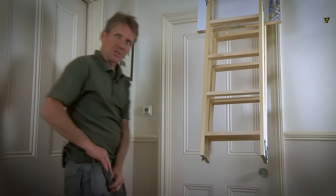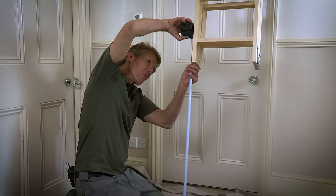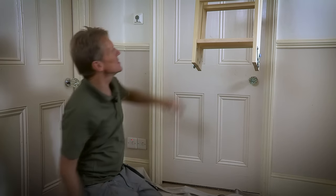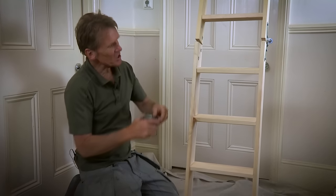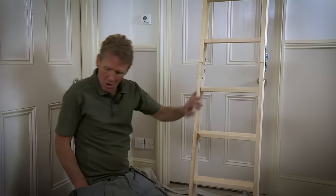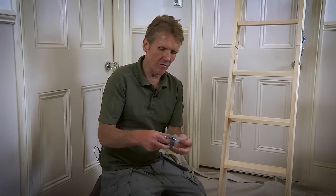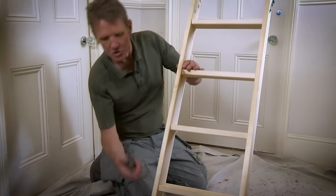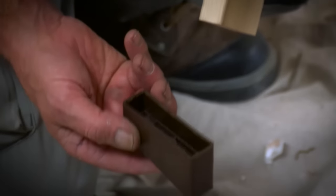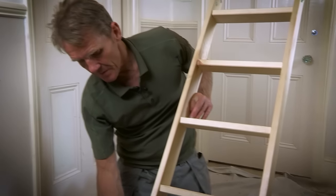You take a measurement from the floor to the bottom of that stile — which is 990mm in this case — then fold that section down and measure 990mm on there before making a cut. The great thing is that it isn't an angled cut, so you don't have to worry about that. What you get in the kit is a couple of plastic scratch-resistant feet — so if you've got a wooden floor it's not going to damage it. You slip on these pre-angled feet, which are a really snug fit, and there's a countersunk screw in the bottom of each one to keep them in place.